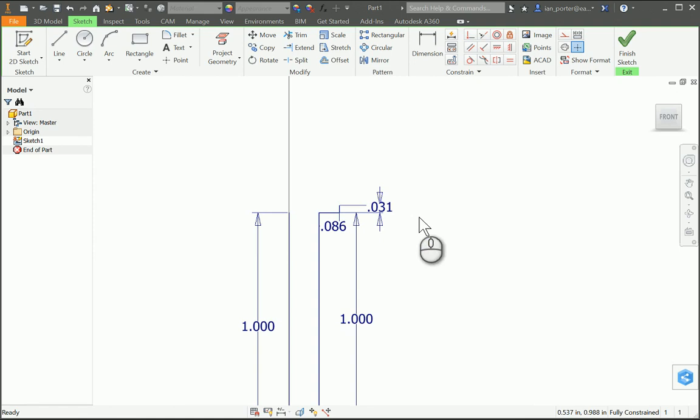I now need to do the rest of the distance of the top of this cap. The cap goes from the one-inch line straight up to the flat surface on the cap, and that distance is 0.125. So I'm gonna go to the end of my line that is at one inch and go straight up to 0.125. Right-click OK — you can see that 0.125 inch dimension.